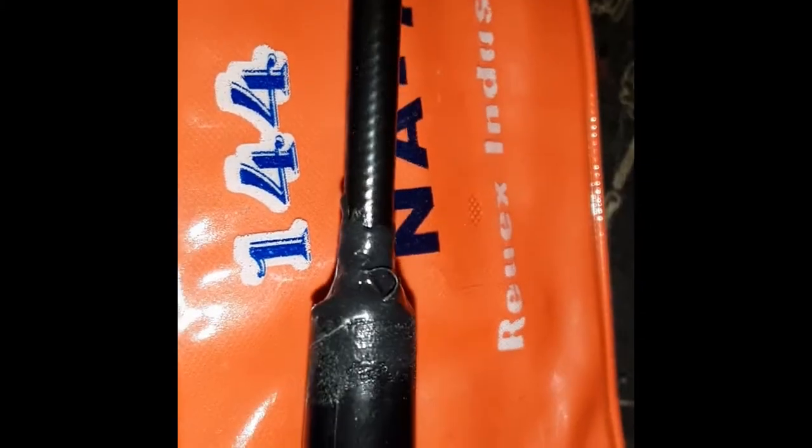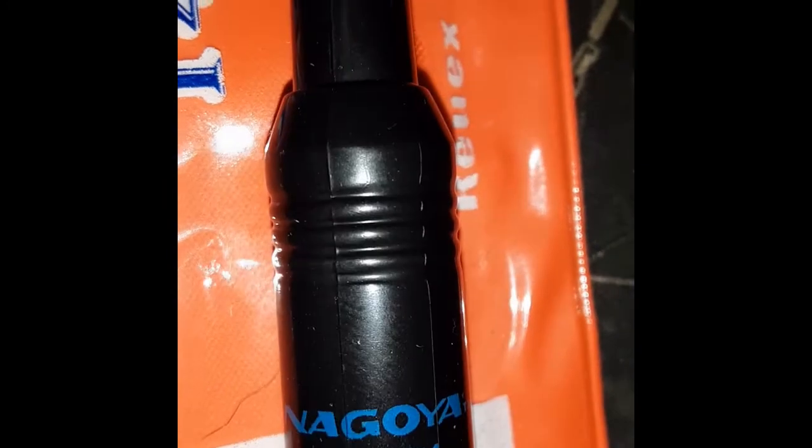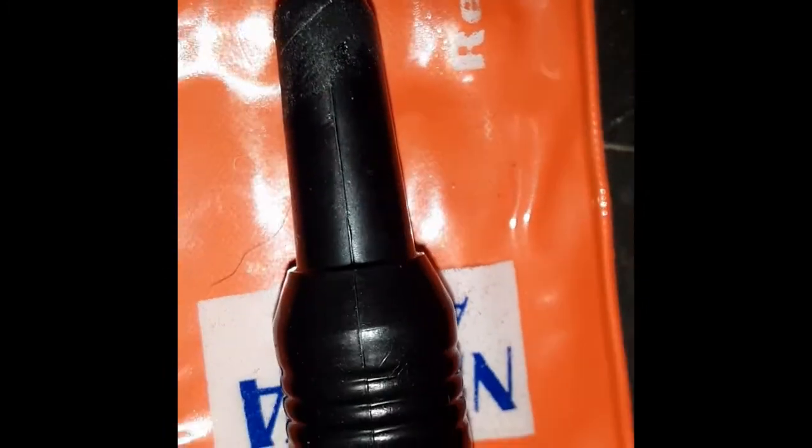I do this to all these Nagoyas: I take some two-part epoxy or some JB Weld quick-set. JB Weld is non-metallic — there's no metallic fibers in it. Mix them up and right where the base of this plastic piece comes up onto the whip section, I just apply a smear and spread it out. Doesn't have to look pretty. What happens over time is these plastic pieces will slide up off the assembly — you can see the seam there, which is another clue it's fake. So a little JB Weld or two-part epoxy around that part holds them tight and lasts a lifetime.